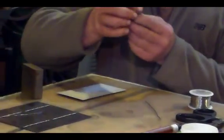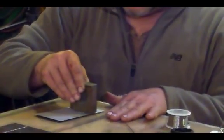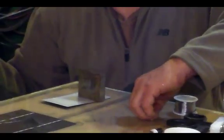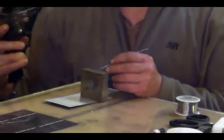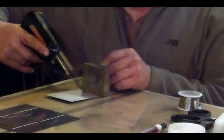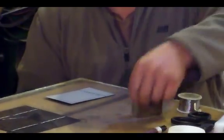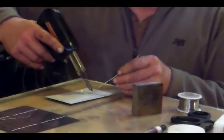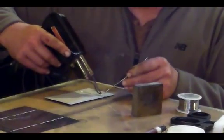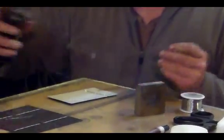I line it up. Another trick: I take my finger and I make sure that my tabbing wire is very straight. I set the block gently on the cell, come over, and preheat my soldering iron — just a little heat there so I'm not vibrating and hitting my cell with it. I place it on the tab, get a drop — boom, right there, that's one. With the block, a lot of times after you get that first solder there, it actually just sets there very neat and pre-positions your wire where you're not having to chase it or getting lifts off of it.